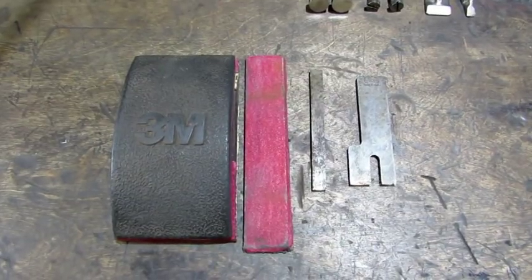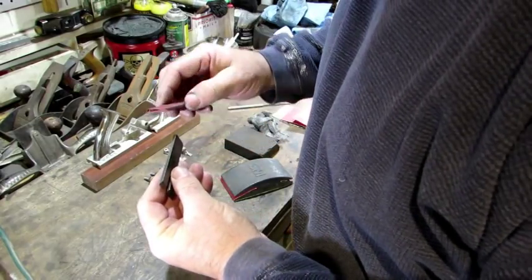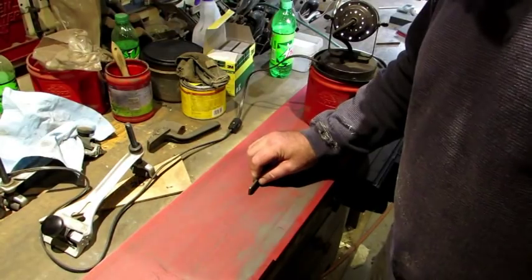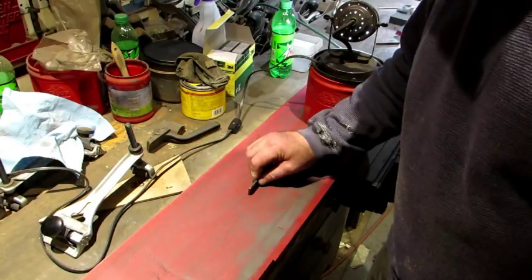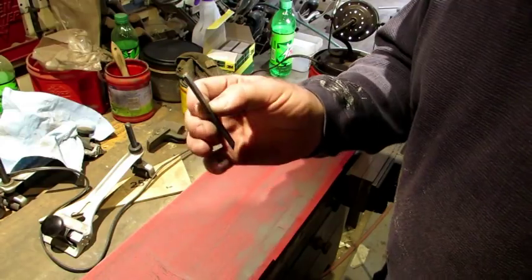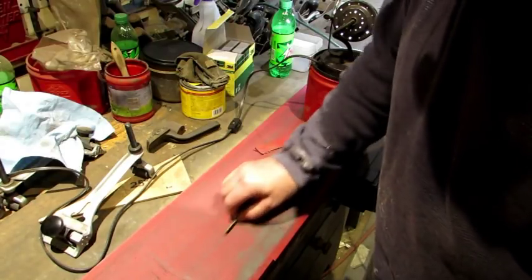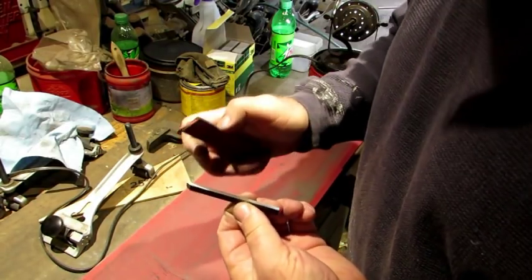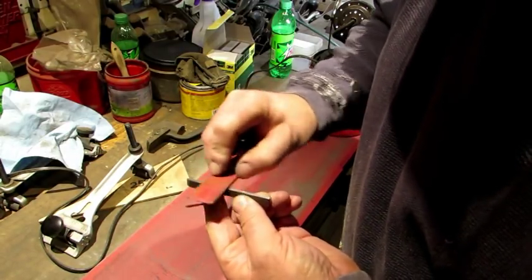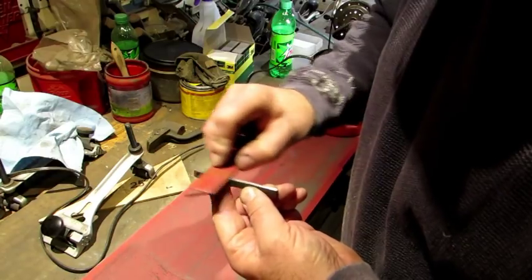Back to the irons. The first thing I want to do is clean up the outer edges using 150 grit paper on my sanding block and sanding stick. The large iron has one machined edge where I can get my sanding stick flat on it and just clean it up. You can do the same thing by rocking it until you find the flat side on your lapping station. What you do not want to do is change the width of this iron, because then your tongue and groove is not going to fit right. It has a slight indent on the sides — they're not perfectly machined flat — so the sanding stick works real well to get in there.